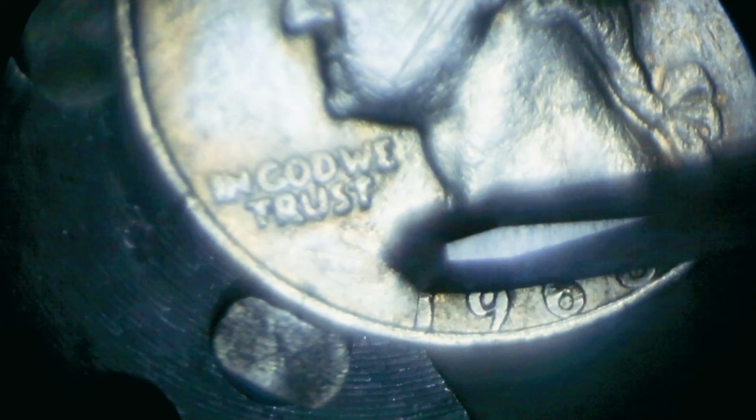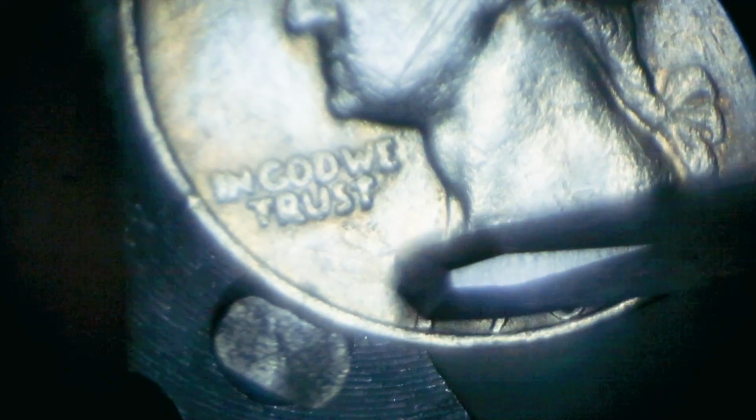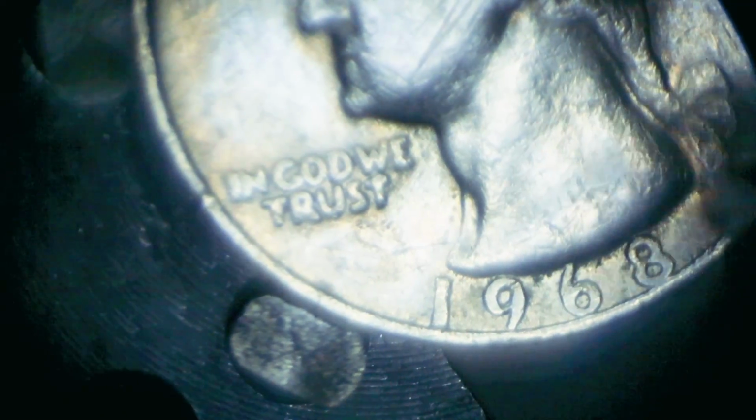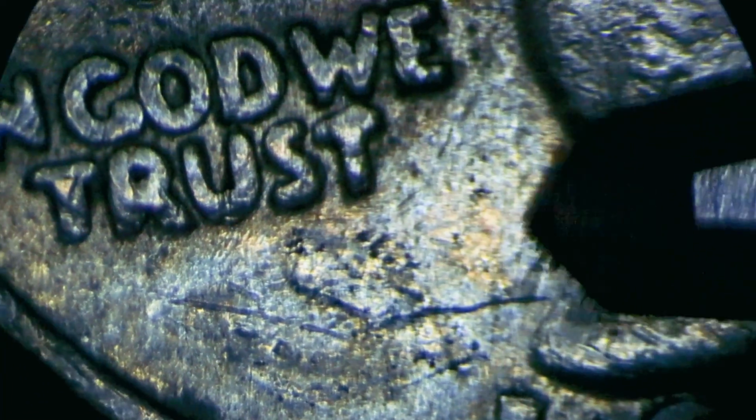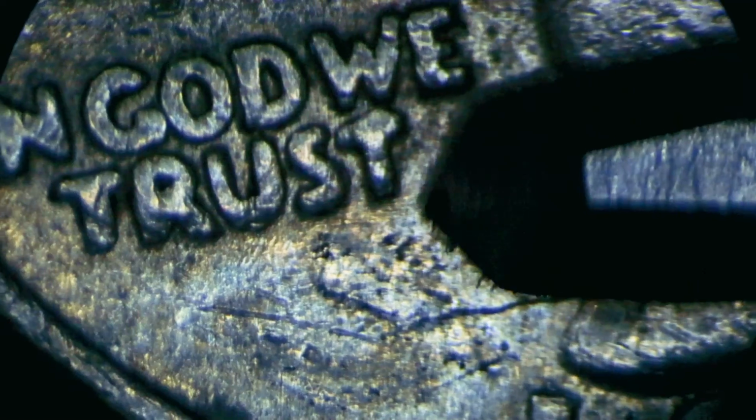My lens must be dirty, because I don't see that through my eyepiece when I look into the microscope. That blurriness there, that's just on the DSLR right now. So I just need to clean something, but I'm not going to worry about that at the moment. I'm just looking at this right here. You can see how huge that graver is. And so then if we zoomed in all the way down here, you could be putting in lines that are just absolutely tiny with this graver. Now again, I have stereo vision, so I can tell how close I am to that surface and whether or not I'm touching it. But if you were just doing a digital one, you wouldn't be able to see how close you were. It's doable, you could do it, but it just wouldn't be great.